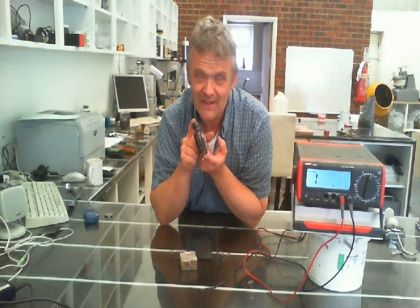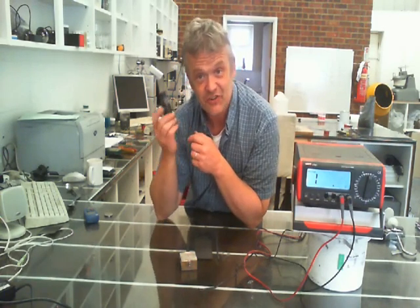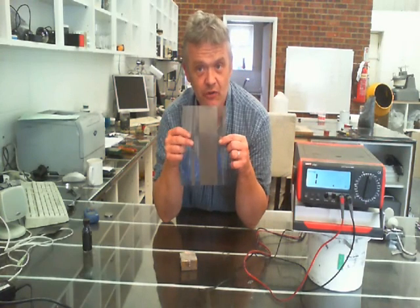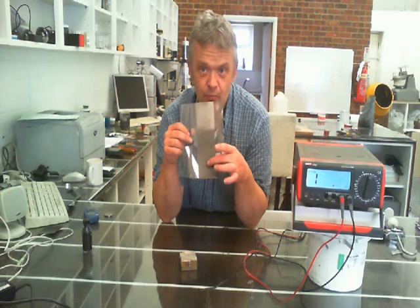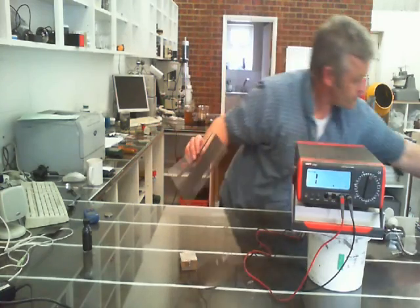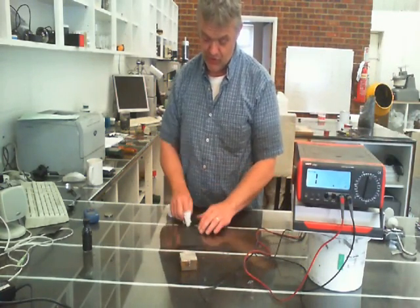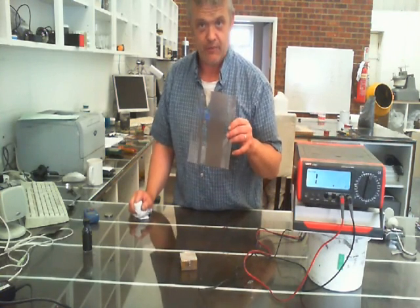So it's more or less purely a conductive ink, and to be honest I think it's astonishing. What I did first of all was just paint on with a doctor blade, and you can see it there. That's the ink when it dries — that greyish grey. And this silvery grey is where I've taken a soft cloth, actually a piece of cotton fabric, and just burnished it with my finger over that until it went that nice silvery grey with finger pressure.